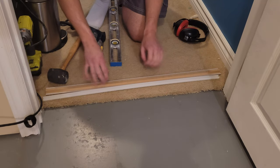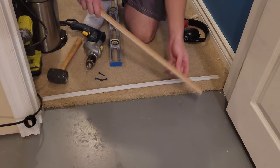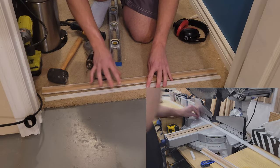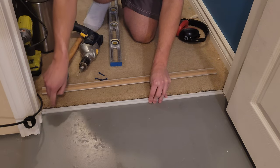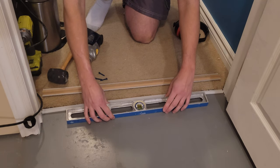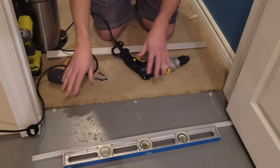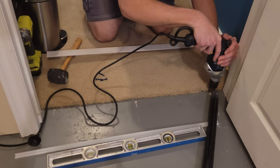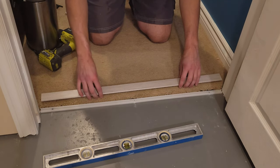Next we're going to install our transition piece, which is going to fill in the gap between the carpet and the laminate floor. These are both relatively the same height so I'm using the flat transition piece. They come in eight feet and this one is about seven feet — I already cut these down to fit right between the door jamb. To install this I place it here and drill with my hammer drill to install tapcons in three spots — that should be plenty to keep it in place. I'm pushing a level up against it because this plastic piece is prone to bending and flexing. Once the laminate is started, I can come back and hammer the transition cap into place.